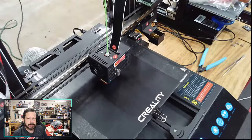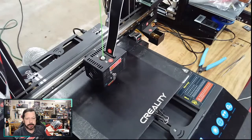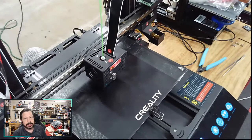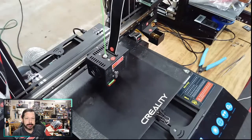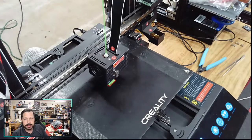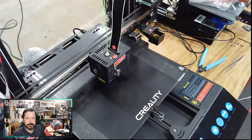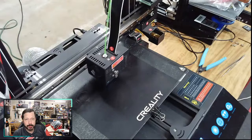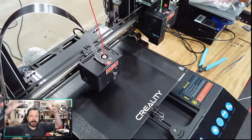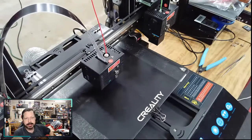There are 2 other ways that you could get there by adding on to your existing printer to multicolor, and they get more than 2 colors. So one of those ways is Prusa. Prusa has a multi-material upgrade where it takes 5 filament inputs and runs them through your 1 nozzle output. And so it will periodically chop up a piece of filament, send it through, and then send the next color through when it's needed. That's another one of those where there is a purge tower that goes along with this. So I'll drag that out at some point before the quarter is over. It's harder. I might have to just take us to it because it's kind of mounted to the wall, because you do have to have multiple filament spools feeding it, and so it's kind of hard to move around. But I'll at least let you see how that thing works.